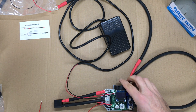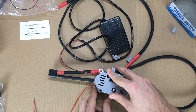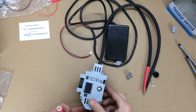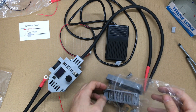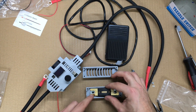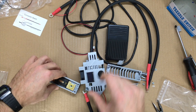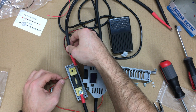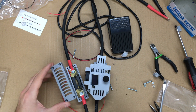The top half of the case goes on here and I'm going to stuff all the wires in. Stuffing this all together is a little easier said than done. Then we use all the hardware to put it together. Once the case is together we put the rotary encoder knob on. Now we'll do the fuse case — adding M5 nuts, then washers on top, then the fuse, then a brass washer — and connect this to the positive output of the battery. We do the same with the positive welding wire, sliding the red silicone wire from the case in with it, then close it up.